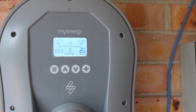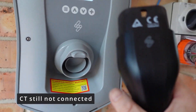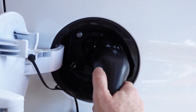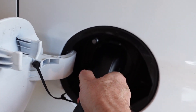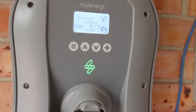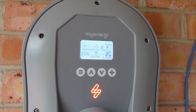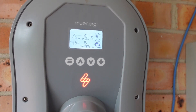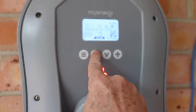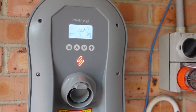I better set it up first before I do charging. I've set up some basic stuff — probably not complete, but good enough for Australia. So I'm going to do my first charge. It's got a 5-metre cable, so let's plug her in and see if she detects. I heard the car lock, and we've got green — charging! 5.5, 6.7 kilowatts. Installation limit — I haven't set it up properly, something's wrong, but you saw it, it was charging. Stopped — okay, did charge for a second.